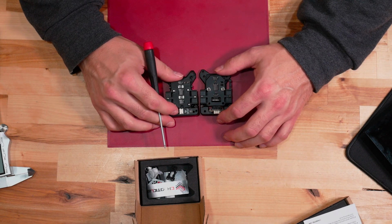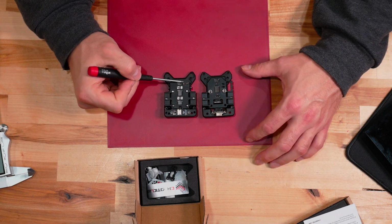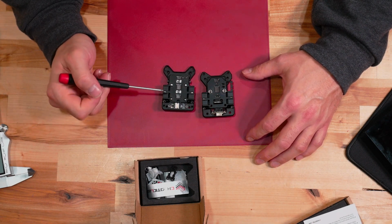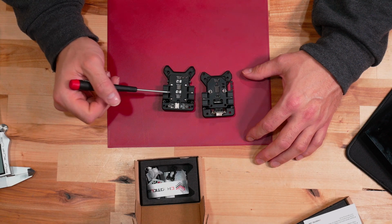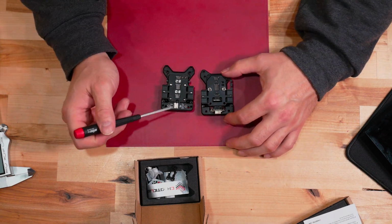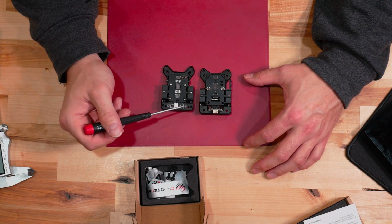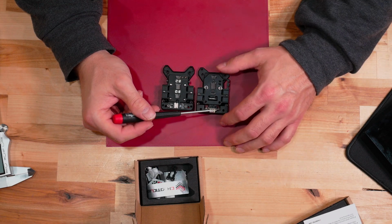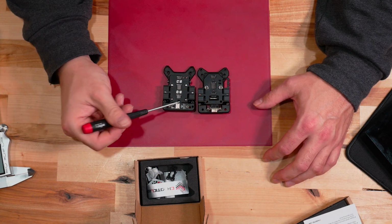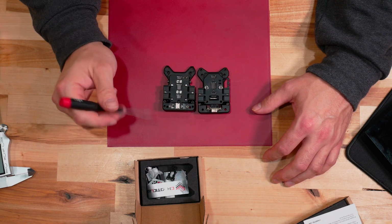3mm spare screws. I believe if you're going to use the CAN bus, they allow you to attach this for the CAN bus. I'm pretty sure of that. And then obviously we have different optical sensors here. This one being the original, which is 5 volts only, and this one right here, which allows you to use a 24 volt system if you have one. So you can use either or when it comes to that.